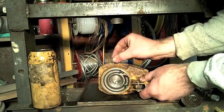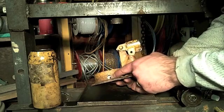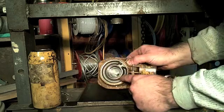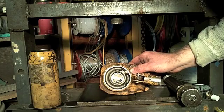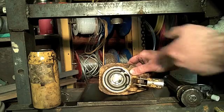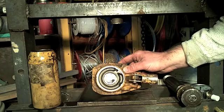The milling is complete. I didn't have a lot of base thickness to work with here, so I had to be very precise. I came down just below the edge of that lip, went inside with a larger hole — big enough that I can then tap it out for a quarter inch pipe. Then using a tiny drill bit, I actually made my incision. It doesn't have to be a big hole; it can be hardly larger than a pin hole, and the gauge will still read pressure. About an eighth inch hole is plenty — it's bigger than the hole in the bottom of the gauge anyway. So this should work perfectly. Now I just need to tap this and give the whole thing a very thorough cleaning, because if you get those metal filings in there it will shorten the life of your jack.